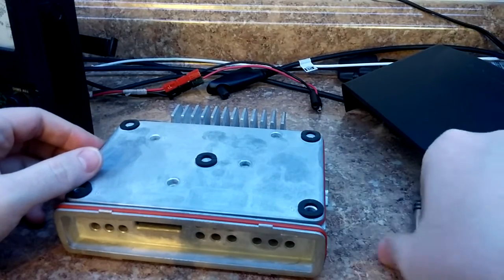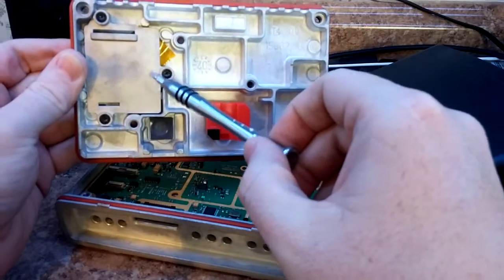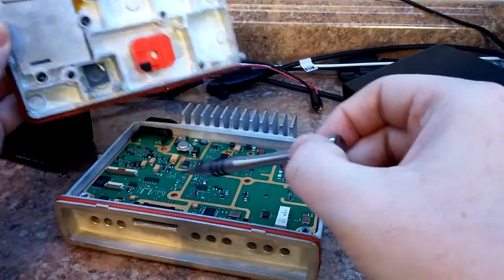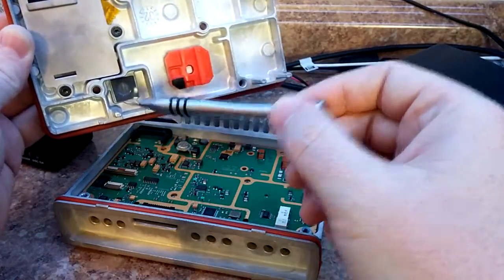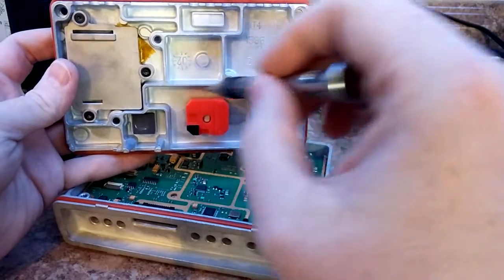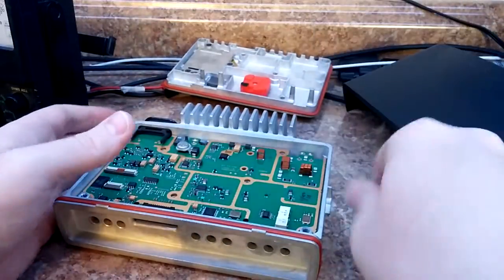You might need a little screwdriver to persuade it open — sometimes you do, sometimes you don't. Pull this off and take a look. If you had a passport board or option board, it would be in here connected with some ribbon cable. You have this piece here which presses down on the final output transistor. And here's your DC block — a little power diode — so that if you connect this backwards it doesn't blow up. You can see how all these little parts on the board line up, with all these little shielded parts. There's no RFI getting on here, and that's better than some commercial radios I've seen. This is a great radio for repeater use. That's why I like building repeaters — they're shielded, it's a block of aluminum.